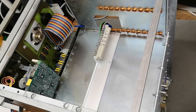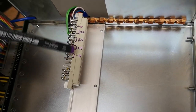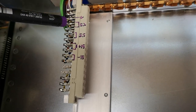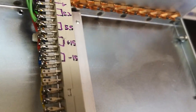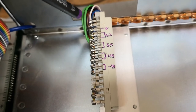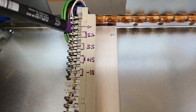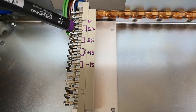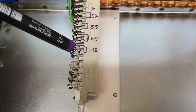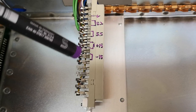This is day two of the Stabilock experiments. I followed the different colors and wires from the power supply. Here's how it works: the four different power supplies each have a thick and a thin wire — the power and the sense line. Voltage sense goes all the way down into the main board and back to the power supply, so it regulates exactly where the power is needed. The specs are: 5.2V at 6A, 5.5V at 2.7A, +15V at 2A, and −15V at 1.6A — a total of 100 watts maximum output.